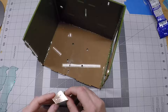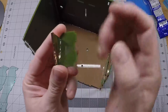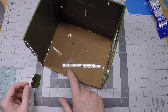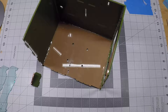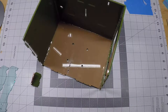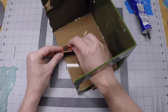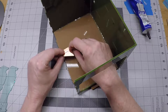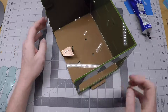The coin sensor is tabbed - it has one large tab and one small tab, which means you can't put it in backwards, and this is where it lives. To cement it in place, we just put a little cement right between those tabs and drop the coin sensor into place. I put a nice little blob there because I want to make sure this part stays in place. Drop it in there, lift it a couple of times to get that cement worked in, then tap it towards the back and make sure it's level.